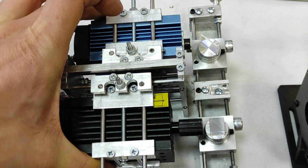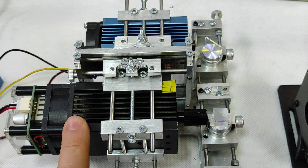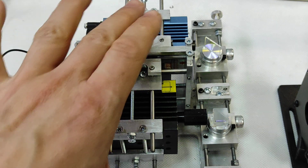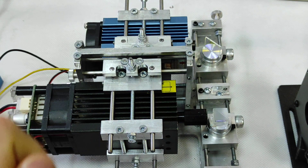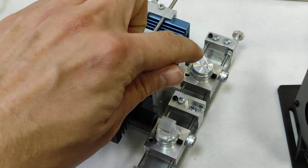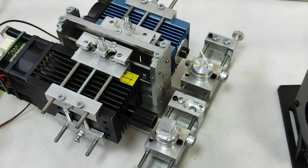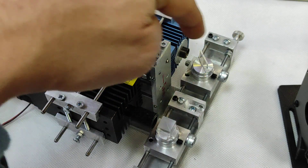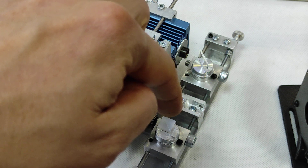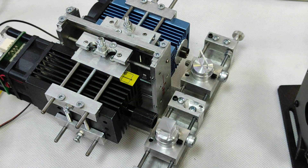The idea of this system is to combine two laser beams together. As you can see, we have a Sainsmart 5.5 watt laser and a 5.5 watt diode laser, and the idea is to make one beam at the end. We have a mirror here that reflects light from one laser, and we have a PBS — a polarizing beam splitter. A beam splitter can split beams, but the same optics also works to combine beams. One beam goes in with one polarization vector and the other with a different polarization vector, and that allows us to combine the two beams together.